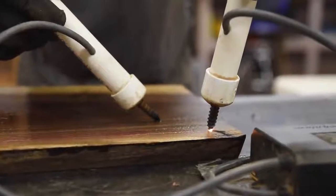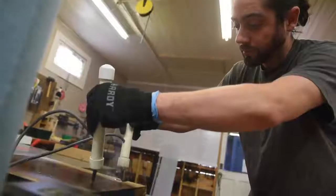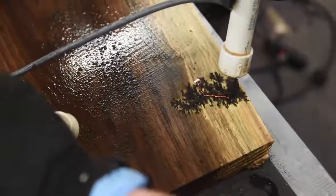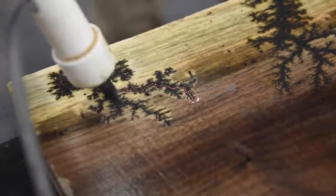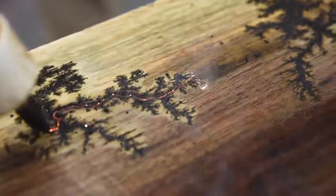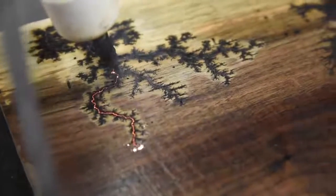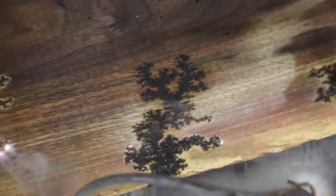The trouble is that's exactly what makes it so dangerous. Every few months a new article pops up about a garage hobbyist that died using a homemade setup. Those high voltages required to make electricity form a circuit through weak solution on wood behave differently than the lower voltages most of us are used to. At high voltage, even air becomes a conductor of electricity — that's how lightning works, and that's how accidents happen. Not touching the work isn't enough to stay safe; you can't get so close that the journey to your body is easier than the path across the wood, and there are no warning shots.